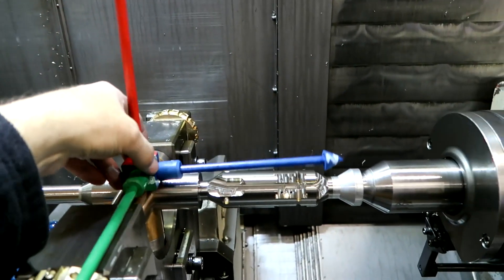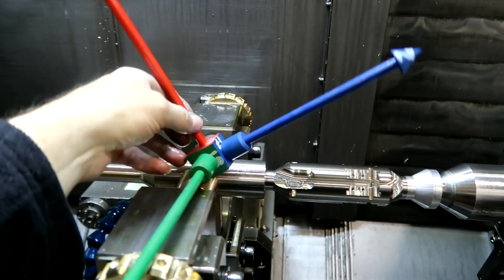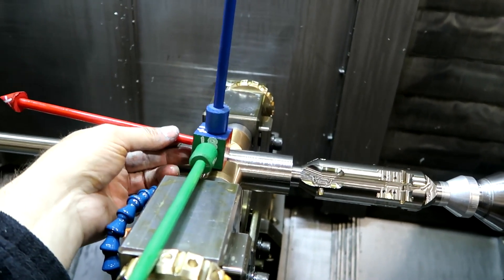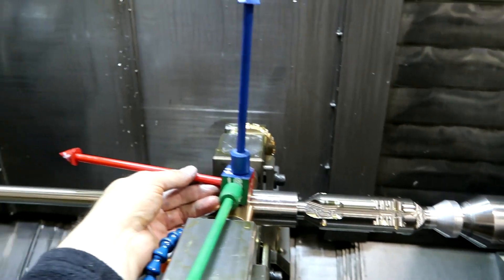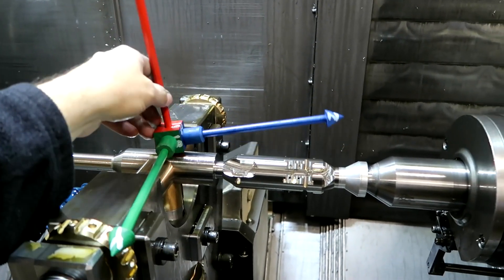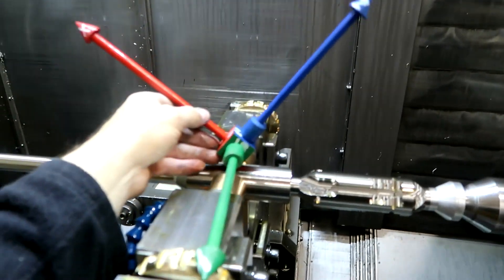Or if you put the B axis anywhere in this zone, basically what you're doing is rotating the coordinate system up like this with a G68 in the program, if I remember right. So as the B axis rotates, the spindle always faces towards the Z direction.